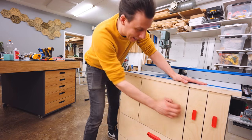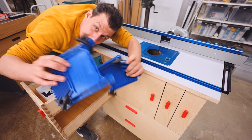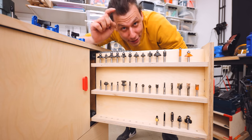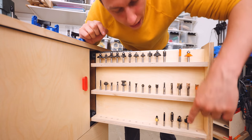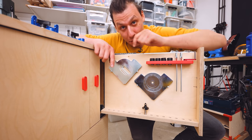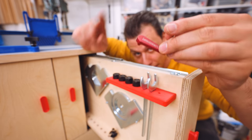I've installed the router and spent a little bit of time organizing the contents of these drawers. On this side I have all the additional bits that go onto the slot and the fence — two featherboards to help push the material up against the fence, a stop block, and a finger protector. I also have all of my router bits neatly organized. I just took a strip of wood, drilled the right-sized holes in it, and attached it to this board — 8mm bits on top, 6mm down here, and the really big ones on the bottom of this drawer. The 12mm is the biggest the router can take. I also have a 3D printed piece that holds all four different collets and the tools to change them, as well as the cute little rotating handle used to raise and lower the router.